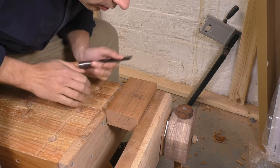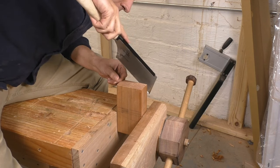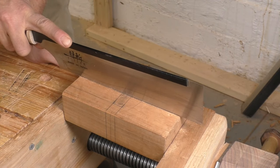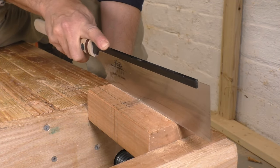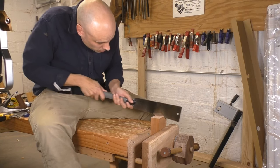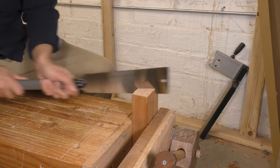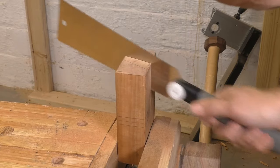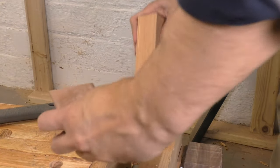Once I've cut my knife line all around, I'll use a chisel to make a knife wall that's going to guide my saw. I'll start at the corners with my dozuki saw, and then slowly pull those cuts across my knife lines, around the edges, and over the faces of the stock. I don't have to cut very deeply here — the point is just to create a kerf that will guide my saw later and ensure a perfect cut. Once I have an accurate kerf all around my stock, I'll switch to my Ryoba with its aggressive rip teeth. This cut is easy because I've created a path for the saw to follow, and it only takes a minute to slice my whole block cleanly in half.